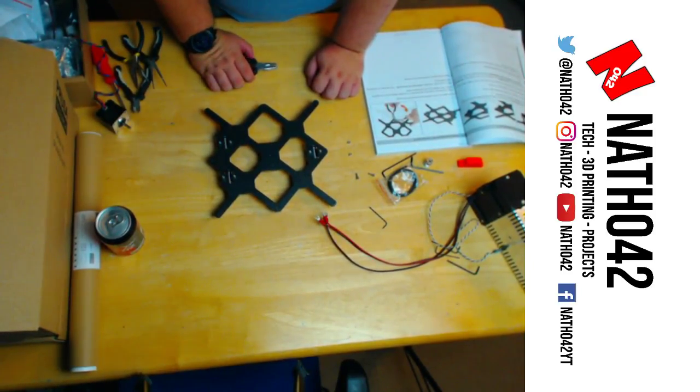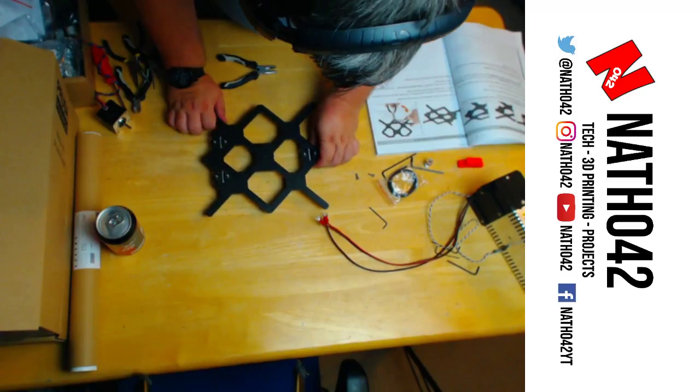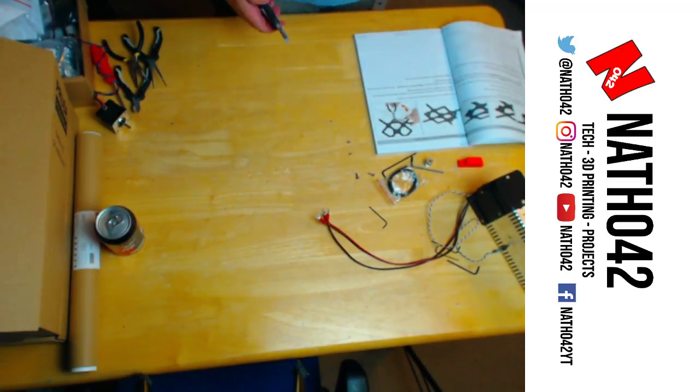Okay. Check if the bearing is centered in both directions. If not, slightly release the nuts and do it again. Yeah, that's centered. I just got a tap. There we go. When you're ready, using pliers, rotate each nut, but only 90 degrees. This is enough to fix the bearing without deforming it. So we'll go from here to here, to here.